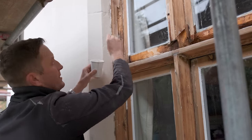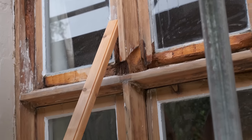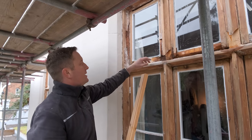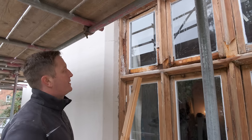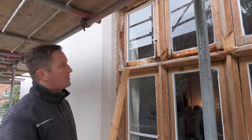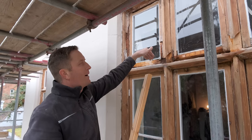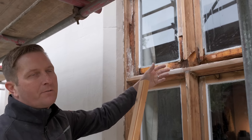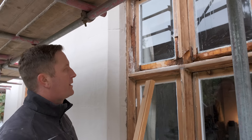I'm just going to use up what's left here to do this, which will be the next phase when I move up to the next level on the scaffold. Here's a piece I've been shaping up earlier — very similar. I will just cut that down to the thickness I want and need — machine bits as they were done originally. So that rail will go down like that, that will go across there, same as before. You'll notice that all of my mitres go that way — this stuff should never ever crack, but if it does, the water runs out away from the window. If you do it the other way, the water can get in. It also works a bit like a dovetail so when you push it in, I haven't got to use any mechanical fixings — it will just hold itself naturally until it goes off. That's the way I like to do things.